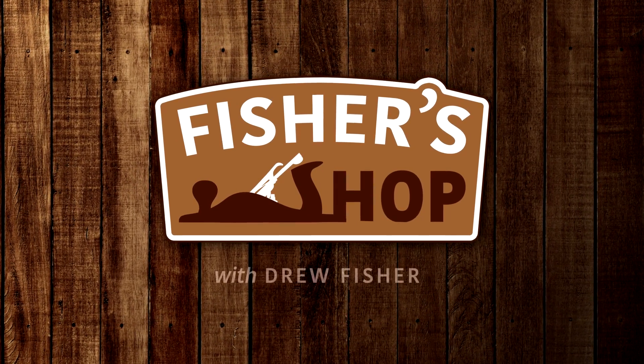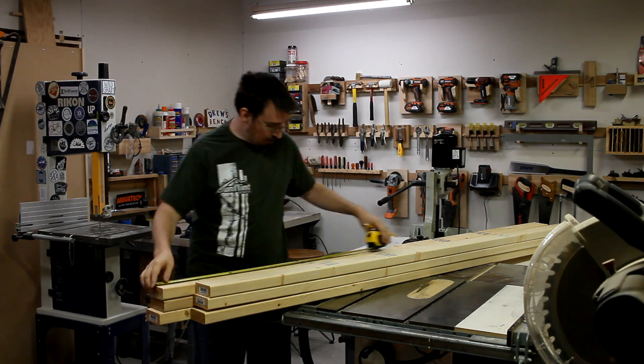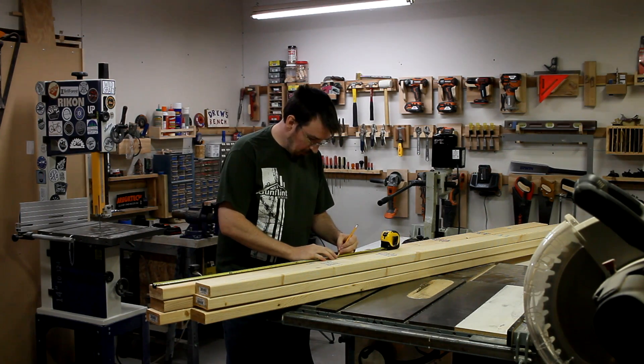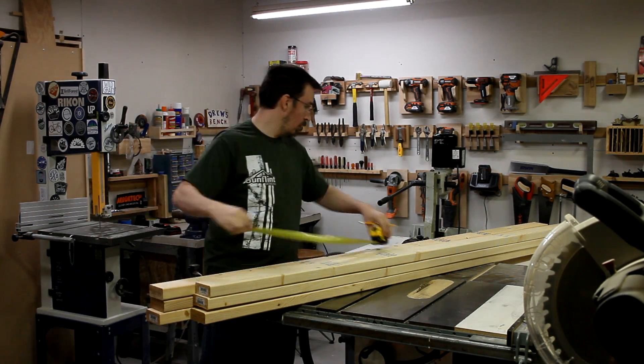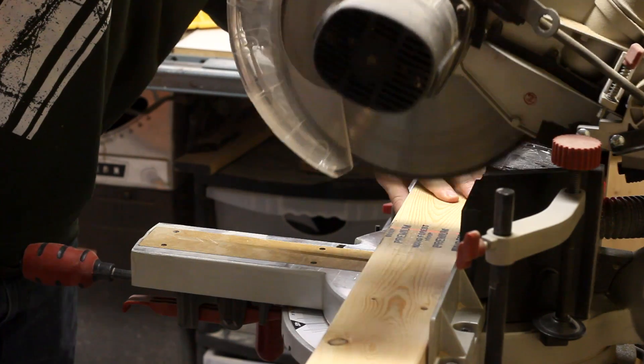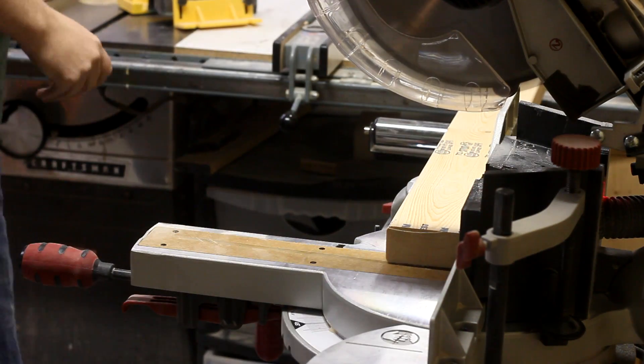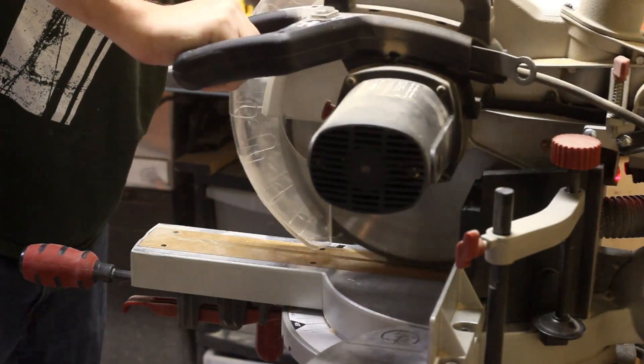So that's what we're going to be doing today. Let's get to it. I decided to use just regular old 2x4s for this project, and I calculated that I should only need 6 to do the whole thing. I first start with a fresh edge, then measure and mark the first piece to cut, and I snuck up to the line with the miter saw. During my sneaking, I create a rough end that I need to clean up before each cut.